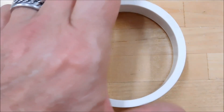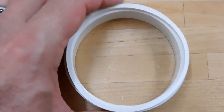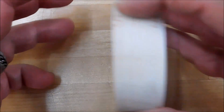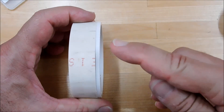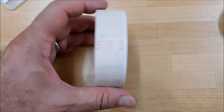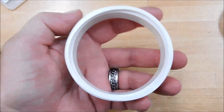And when you knock the plug out, it is going to go back to its normal shape — not 100%, because as the part gets farther from the grip of the chuck extended out, the distortion will be less out here, only because of the strength of the material. So it's a conical distortion. A conical distortion is only gripping right in the front of the jaw and can pull out easily. So be very careful with the amount of tension that you put on these, or any part that you know is thin.